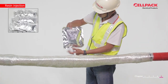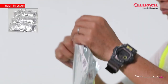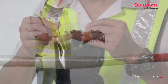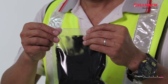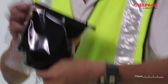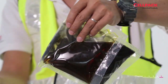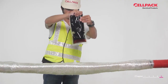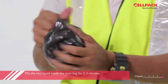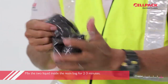Now we shall prepare the cast resin. Tear the external aluminum bag carefully at the tip of the bag so that it does not tear the internal PE bag. When opened, we can see there are two liquids inside separated by a profile separator — these are the resin and the hardener. Take out the black separator at the centre of the PE bag. Gently squeeze and dough both liquids between 30 to 40 times; this would take approximately 2 to 3 minutes. By this time you will see the colour mix is consistent.